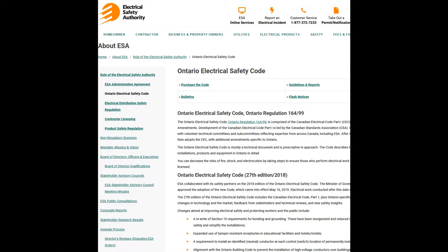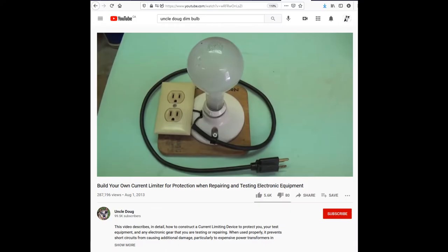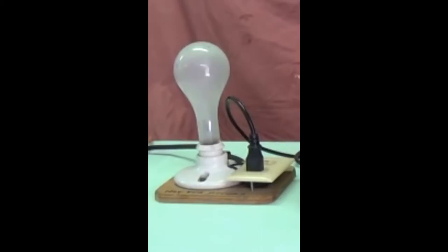Electrical safety code is not just how the wires are supposed to be hooked up — it's also how the wires are presented to the end user. Take for example our favorite uncle's dim bulb current limiter. It looks perfectly safe from a head-on view, but if you take a look from the side suddenly you notice that it is not up to code at all, as it's not in a box. Little fingers could possibly stick underneath that slot and hit the live wires. Definitely not safe.